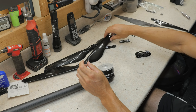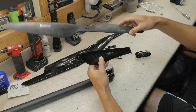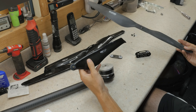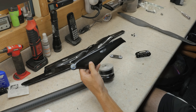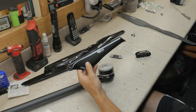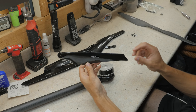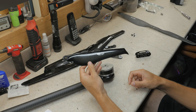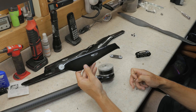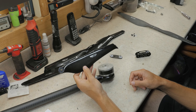I really hope they fix this and beef up these screws because, honestly, these propeller blades are amazing. I've been using the standard T-Motor propellers for about seven years now and they've been kind of the golden standard. But I found that these F8 blades are better balanced, produce about two to five percent more thrust, and are about two to five percent more efficient. The biggest benefit — and I'm guessing it has to do with the winglet design — is they are significantly quieter. It's a much more enjoyable experience flying these in close proximity to people; they don't bother people when you're flying big drones around them. Hopefully they fix the screw issues.